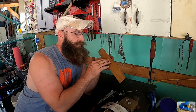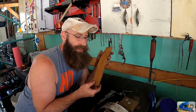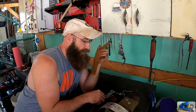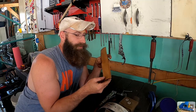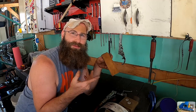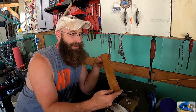Talk about some really tough material. We went after this thing with a sanding disc on the angle die grinder, a manual wire brush, and then ultimately ended up with a wire brush on the angle die grinder, and we had to really just get after it. You couldn't sit in one spot and try to rough it up because it didn't really work. It would kind of smooth itself out, so I had to kind of bounce it, and that's about the only way I could get any indentations or scuffs on it.